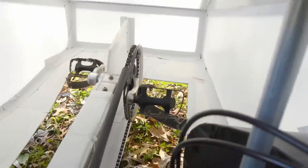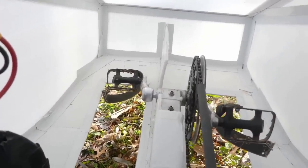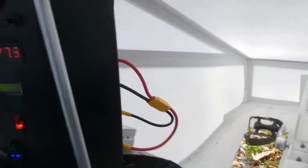So this is a free wheel here, so I can pedal or not pedal to assist the electric motor. I have two gears in the front, so if the motor would die and I'm in a steep hill, I can drop the upper one down to the lower sprocket. And I do that just by moving this manually. And then underneath, chain tubes and a 6-speed rear sprocket